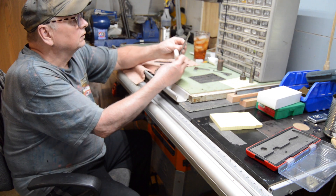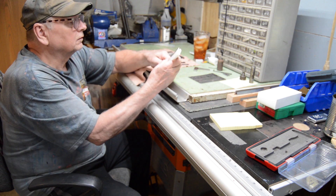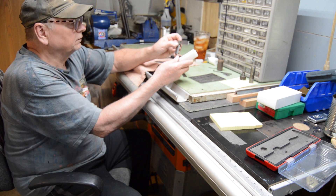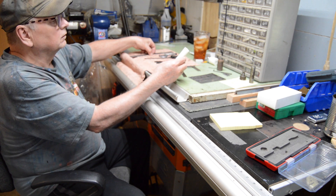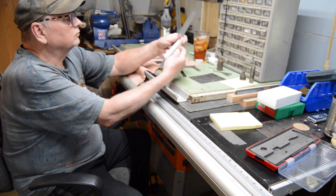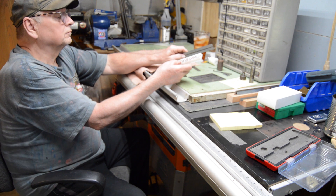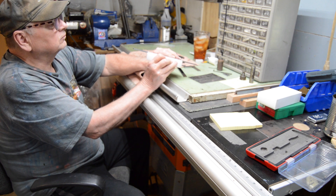This is a 3/16ths bar — 3/16ths thick. It goes down in there but you have to force it. That's pretty nice. I checked everything — nice and square. It milled 3/16ths by 3/16ths thick or deep. I'll take some pictures of it. Nice and straight — this is where I went along the edge. I'm not real happy with the finish on that, it's a little rough. Actually it's kind of neat looking — it looks like a wood grain texture. But as far as straight, it's just as straight as it could be.